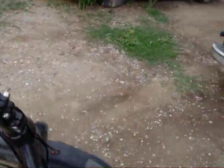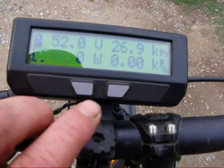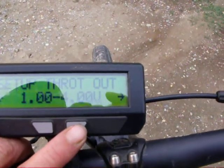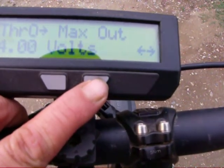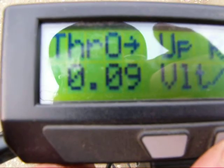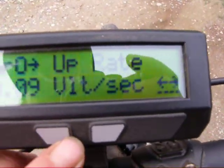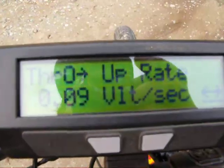So what did I have to do to make this function? I'll go into the settings. Throttle in, throttle out, throttle output, max out, down rate, up rate. Here's what we throttled back to make that sensorless controller ramp up nicely. We're throttling up at 0.09 volts per second. The fast rate we left fast, so it picks up quick. The key is slowing the ramp to 0.09 — it stopped shuddering and ran smoother. Every now and then it gives a little shudder, but all in all this thing runs pretty good now.